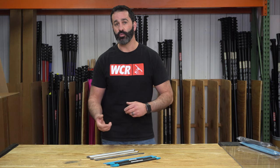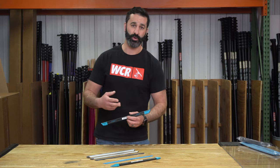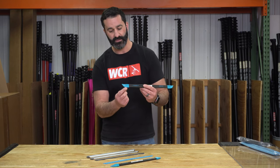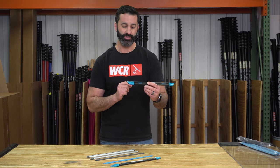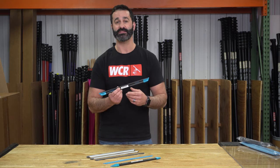A couple years ago, Moerman came out with a channel called the Liquidator. It was the 1.0, and now there's a 2.0 and a 3.0. The Liquidator channels come already on an angle with an end clip, specifically designed to put just the right amount of pressure down on the corner of the rubber to eliminate a lot of that detailing work.